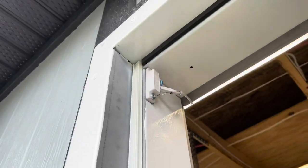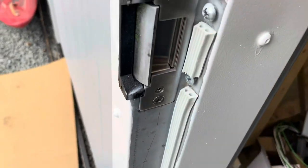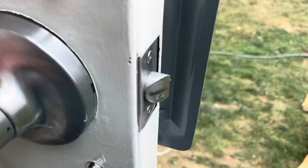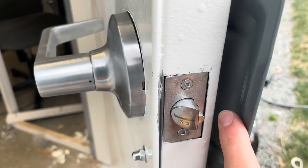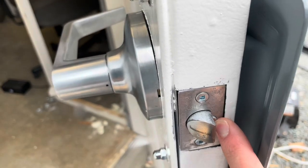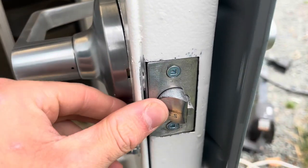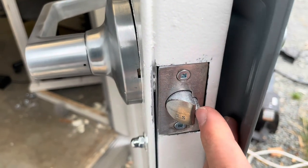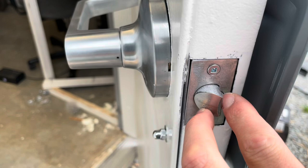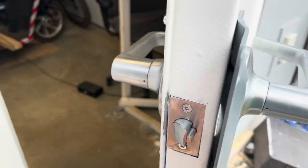I did seal this door up all the way and put weather stripping around. I had to put some thinner stuff on the top otherwise it would keep it from closing far enough, but all of that works good. I've got the guard latch set up right. The guard latch is this little one here — when the door latches this part goes behind the strike plate and pops back out, but this little guard latch stays held up on the edge so that someone can't slip something skinny in the door and pull it out. If this little one's depressed, the big one won't go in more than about a third of the way, so you've got to have that set up properly, which I do.